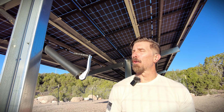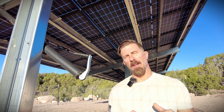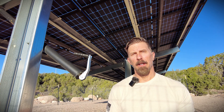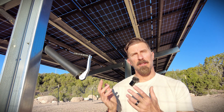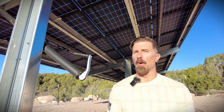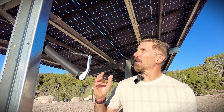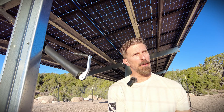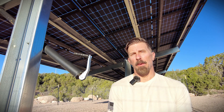So that's the Sinclair Seasonally Adjustable Ground Mount system. I really like knowing that we've got the ability to chase the sun as it changes its angle in the sky to maximize the efficiency of the panels. I also like that we can use this pea gravel down below on this flat deck to bounce sunlight back up to these bifacial panels and gain even more efficiency that way — something you can't do with roof-mounted panels. And I like the fact that the wiring is nice and neatly configured underneath the array so that when people visit the ranch everything looks clean and well thought out.